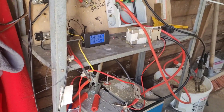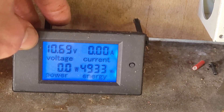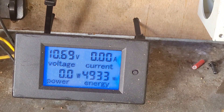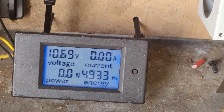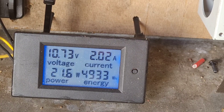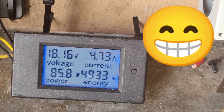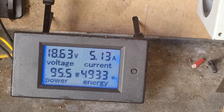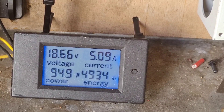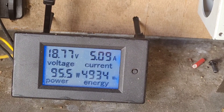Please bear in mind I'm incredibly weak, and so is the battery at this moment in time. This is just running basically exactly how the wind turbine would run — the meter doesn't know any difference. So I'm going to leave that on there and start pedaling. That's about 60 RPM. I'm not sure why it's going up to 18 volts — that may mean the battery's dead — but that's 100 watts fairly easily.